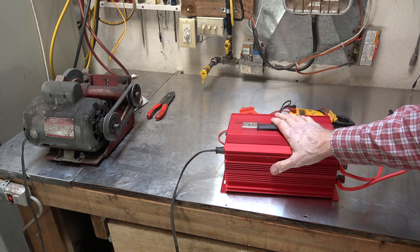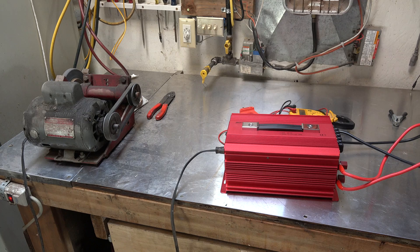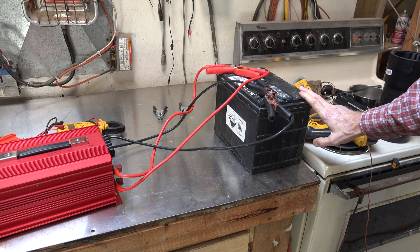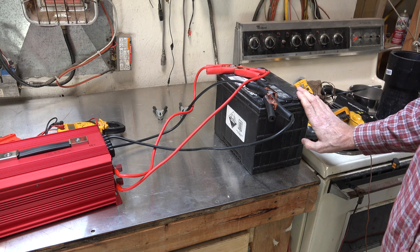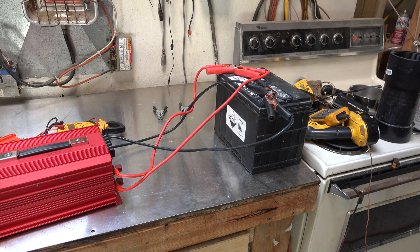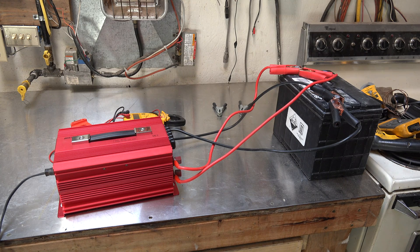One thing I don't want to say is that this inverter is totally incapable of starting a load like that, because the conditions aren't perfect for it. This is hooked up to an automotive starting battery, which would probably be the best for this type of high startup draw. However, if there was a bank of four, five, or ten of these batteries, you may find you had different results. So I'm not condemning this thing completely just because it didn't work with one battery.